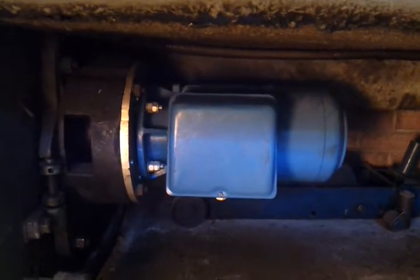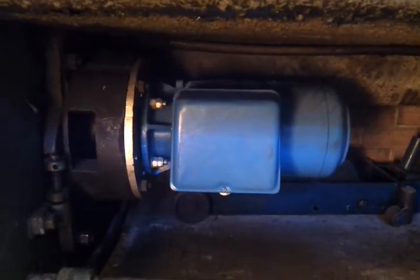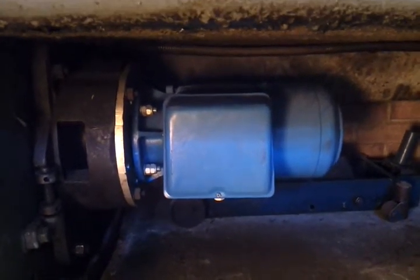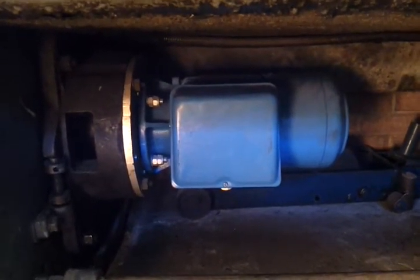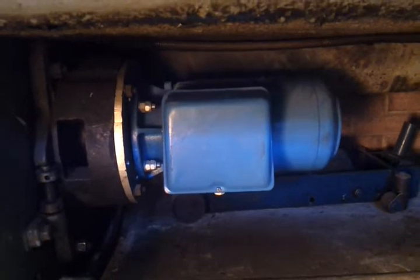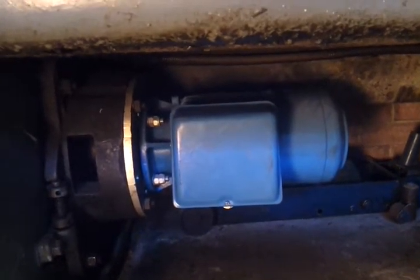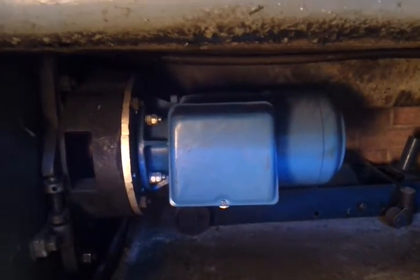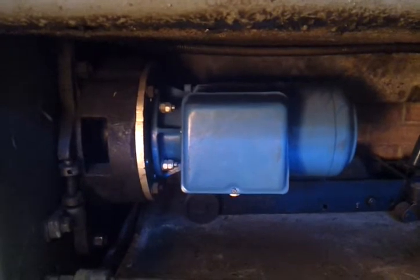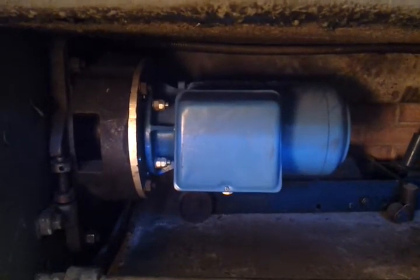I bought a new motor for 3-phase, and I've got myself a 4 kilowatt 3-phase converter as well, which I'll wire up to the garage once I upgrade the wire going from the house to the fuse box. Because that'll have to go up to 35 or 40 amps or something like that. But that has to come off sometime.